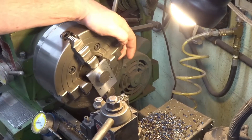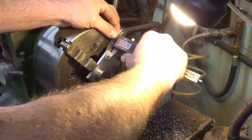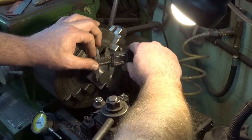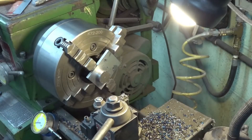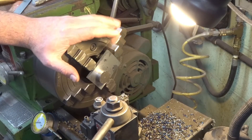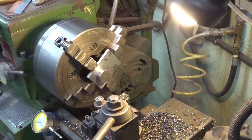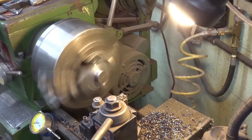Okay, we're going to go ahead and get everything mic'd. I am exactly where I want to be — about 20 to 30 thousandths over. So what we're going to do is cut 20 thousandths off of this and then cut our final 10 off, and that'll be it — it'll be done. We'll just cut our final numbers here and we're good to go.